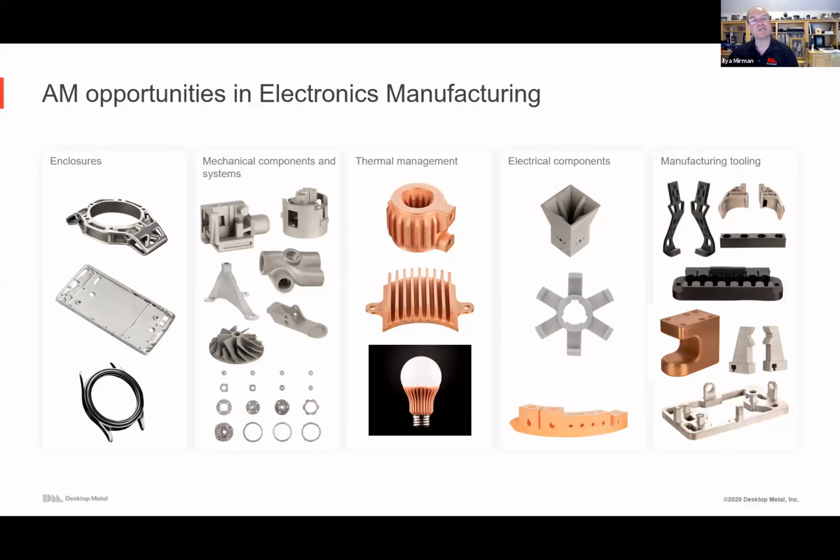These were simpler and quite often stamped out of aluminum. But as phones get bigger, as we put them in our back pocket and sit on them, they flex, so they have to be stiffer. Suddenly you need stiffer but you don't want the phone to be too heavy. So believe it or not, what used to be simply stamped is now machined, even sometimes forged, and all of that requires setup and tooling. There are factories in parts of the world with 10,000 CNC machines in one place, spending 20 to 30 minutes machining out enclosures for consumer goods like smartphones.